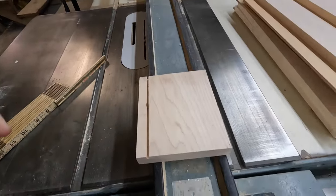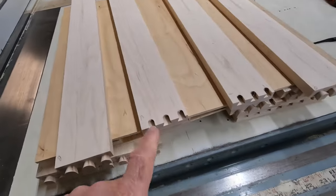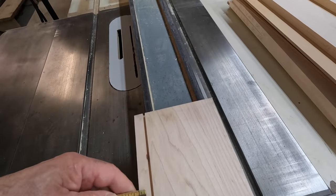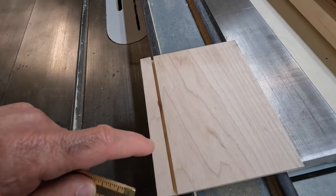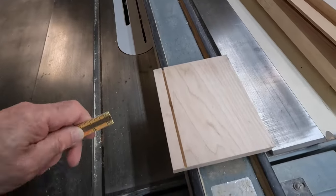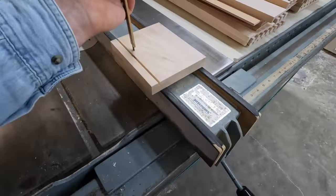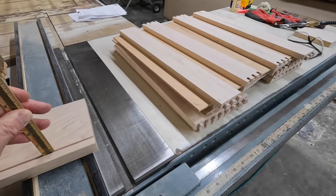Here's the cut — you can see that's pretty decent. What you need for these dovetails is a cut to go right inside of here. It works in two ways: you need a half-inch clearance from the bottom of the drawer to the drawer bottom, and our next cut up here will dial it in. You need a quarter-inch groove — always have trouble one-handing it, but there you go — there's your quarter inch.